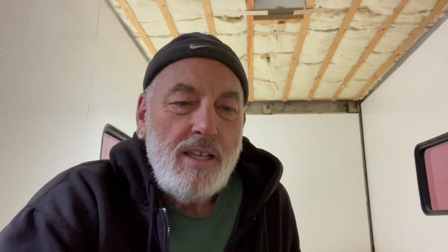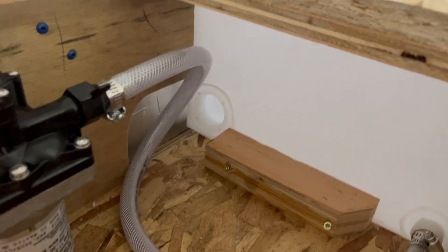It's time to do some more plumbing. This stuff, it's always fun. When you're doing it from scratch like this, you get to make choices about where things are located. I have a very limited hole over here for that water pump and the accumulator tank to go into. Instead of making short hoses, I'm going to put them at the end of big loops — it makes it much easier to connect and disconnect the hose if you ever have to do a repair, if you have some hose you can slack out. That's what I mean by having some slack in the line.